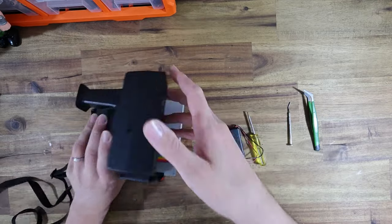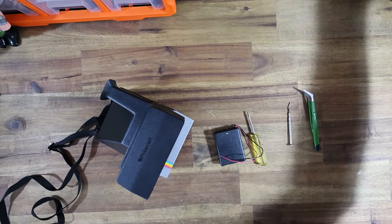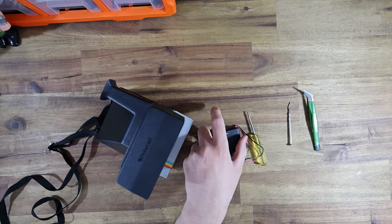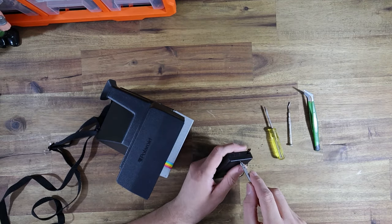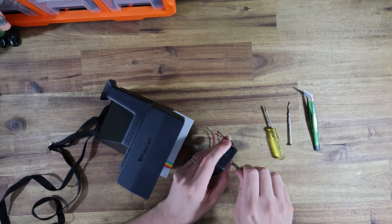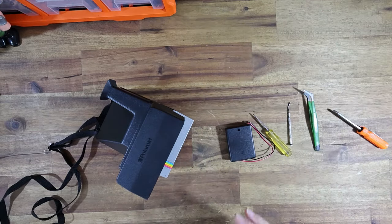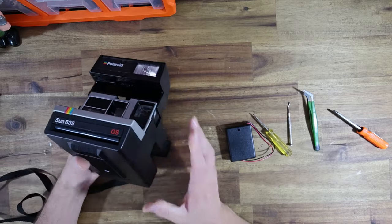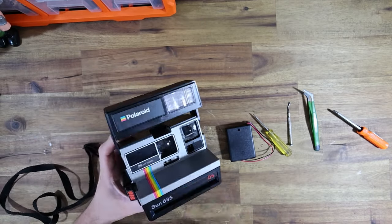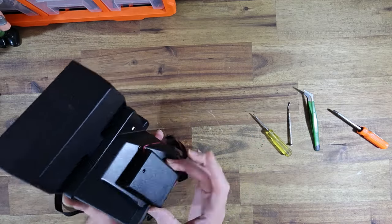This will be the second I-Type conversion I've featured on this channel, with the first one being a one-step SX-70 — a box-type SX-70. The main difference with this conversion on a 600-type camera versus the one-step is that on the one-step, being designed to take SX-70 film, I had to modify the internal capacitor. But this camera, we're not going to need to modify anything except for powering it off of AAAs.